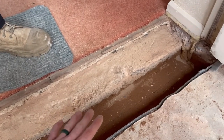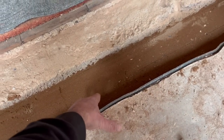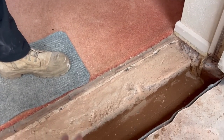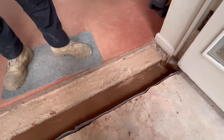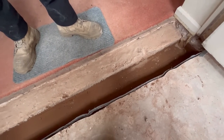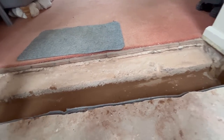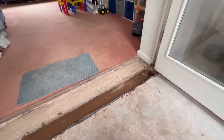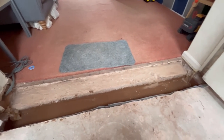And then we'll put some DPM on top of there now. Then some insulation in there just to give a bit of a, well, is there any real need? But anyway, don't matter. There's no real need because there's none in this, but we don't think that's the point, or I don't anyway. So I'm going to put some in there, and then because this is only about 60 mil or so, that bit there, we've got some pea gravel. So we're going to make up some pea gravel concrete and fill that and float all this in just to get the levels. Same as we did over there.